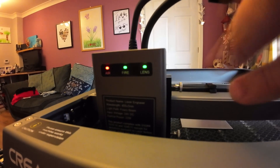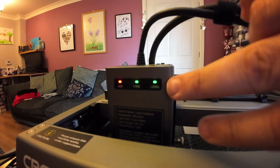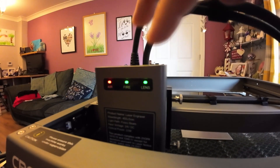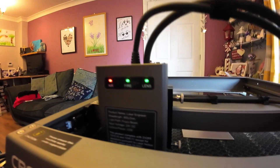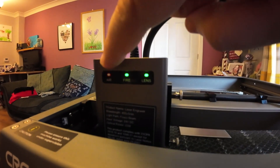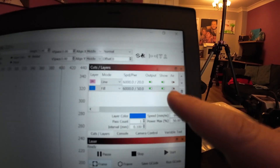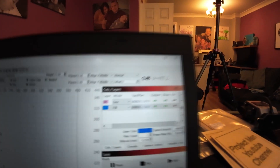With the lens light being green, that's all good - that means the lens is nice and clean. But if there is residue on the lens or smoke build-up from doing wood, that will change colour too. So when using air on wood you want to see three green lights. But as we're engraving on metal, we don't need the air on, so I've actually turned the air off in settings because you don't want air on the engraving.